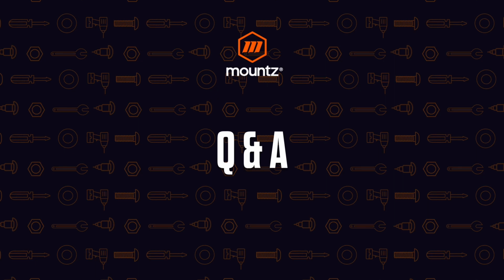Okay, and you may have just answered this, Dave, but I'm not 100% sure. Is there a standard filter setting for click tools? And if so, what is that? And then what about for battery or power tools? Yeah, so standard clutch tools and hand tools, you can be at 500 hertz for your filter setting. Again, you would only really need to change the filter setting if you're going to be testing pulse tools. And you'd have to do a little bit of testing to see what filter setting might be best, but somewhere at 1500 to 3000 hertz for the pulse tool.